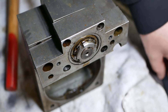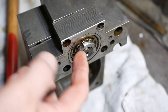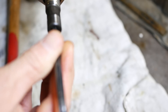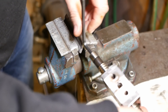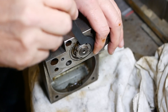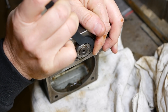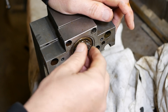In my last video I was talking about how I was a bit concerned about getting this nut off the x-axis ball screw because I didn't have a wrenching flat. Anyway, in that video a bunch of people noticed straight away that the other end of the shaft actually has an allen key slot. Perfect — thanks for spotting that, guys. I'll just back up the allen key into the vise so that it can't wobble around. There we go. Excellent.